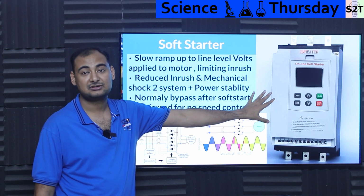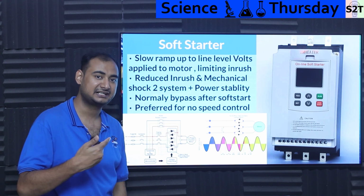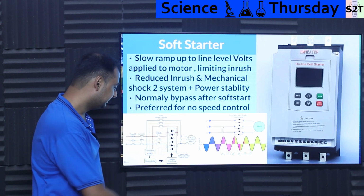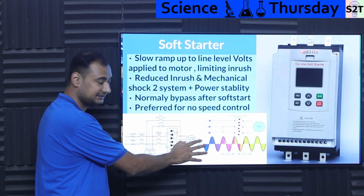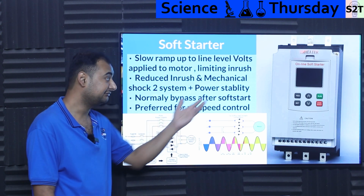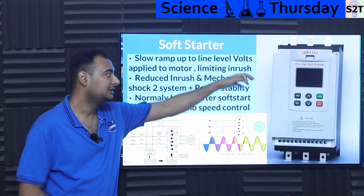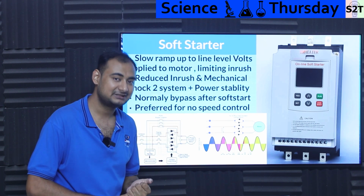So, this also has another benefit. Once you start the running circuit, once you control the phase angle, once it has the back EMF, it can disconnect. Generally you will have the electronic side of it, thyristor firing control. Once you disable it, okay, done, it can run on the mains without any issue. So even if these things fail, you can just disconnect it and run the motor. But again, it will give you the hard start. It will not give you the soft start.